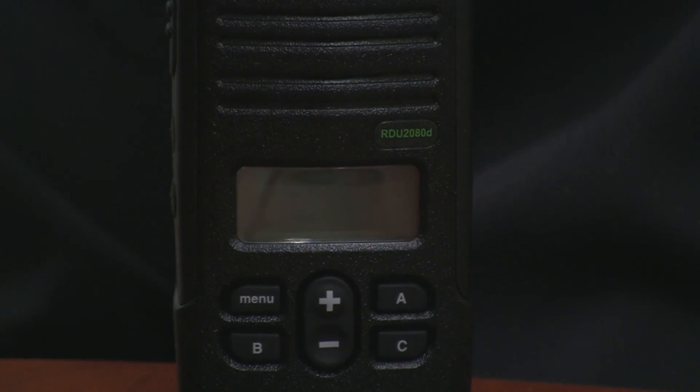With these changes, the radios are going to be completely narrowband right out of the box. So this is going to be better for everyone, unless you've got existing radios. If you have existing RDX series radios, you might need to make a small change to your existing radios to switch them to narrowband mode. When you buy a new radio and it's one of the new narrowband ready versions, it's going to talk to your old radios right out of the box as long as you're using default frequencies.